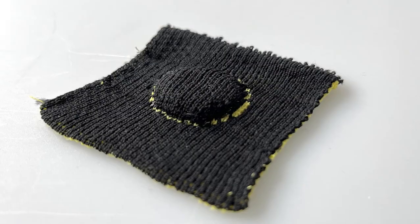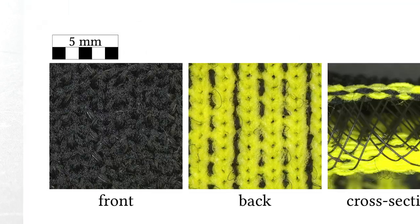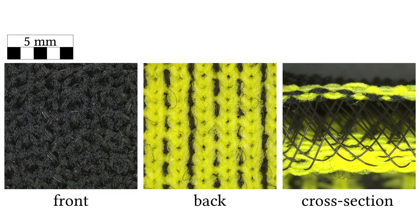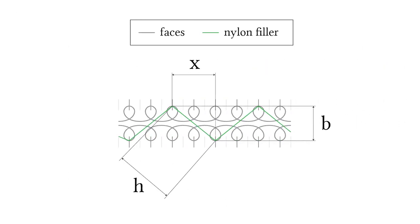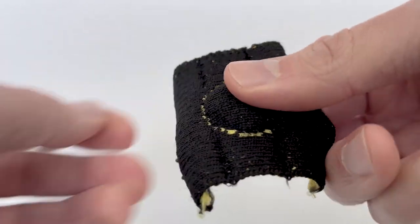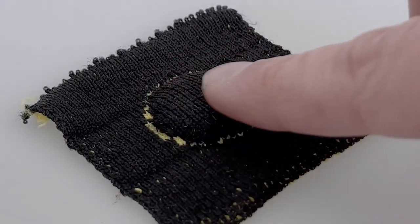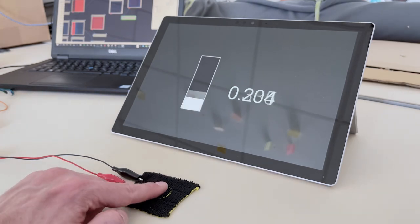With SPACE-R, we present the design and implementation of a resistive force sensor based on a spacer fabric knit. In a spacer fabric structure, stiff nylon filaments press two knit faces apart, which can provide a soft and appealing haptic property similar to foams. In this work, we introduce a sensor that adds the capability of continuous resistive pressure sensing to spacer fabrics.